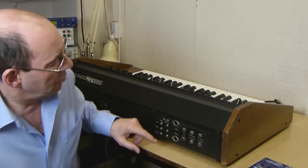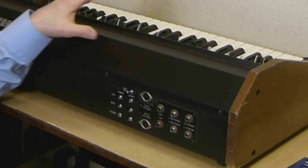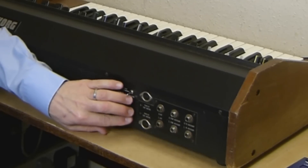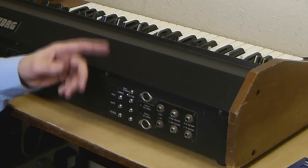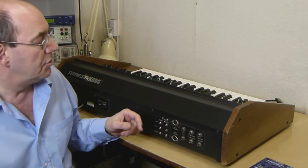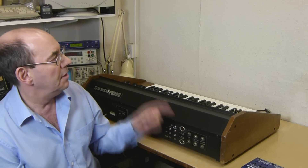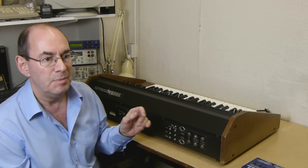As you can see we've fitted six sockets and a switch. In the up position of the switch it's just a normal synth — the keyboard controls the synth. In the down position the sockets become active. If you plug into just the upper section of sockets then those will control both the upper and lower sections of the synth. If you plug into the lower section you get individual control of the two sections. I'm going to show you this first connected to a Pro Solo and then connected to a Pro 2000 afterwards so you can see the two sections being controlled separately.